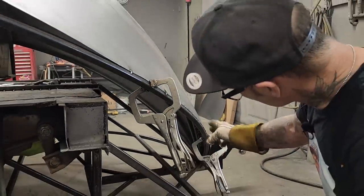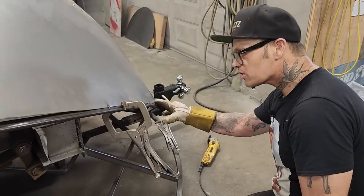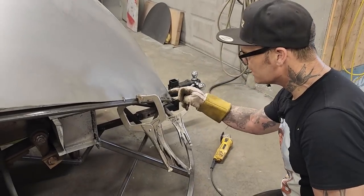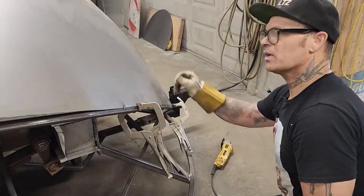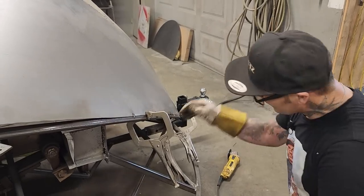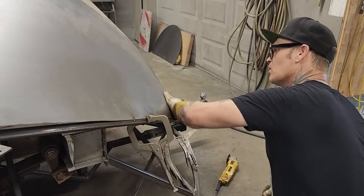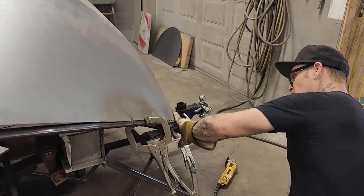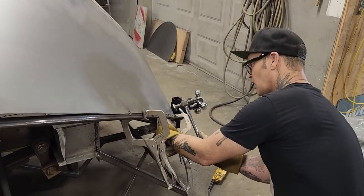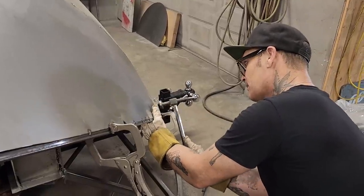Like I say, if I got a little ripple going on, it's where there's too much metal. When I'm hitting that, I'm hoping the metal is going up here. I'm trying not to dent it in. I'm trying to run it up a little bit because there's lots of area here where this can have shape. And if I just go slow with it, I can slowly run some of it up in there. Put pressure on that metal to take shape.